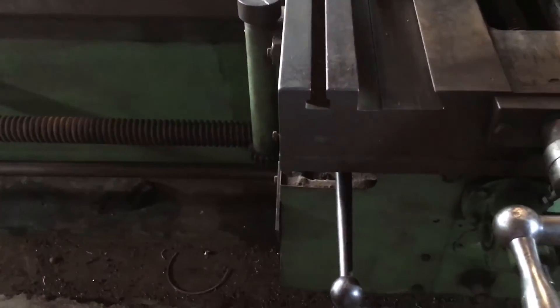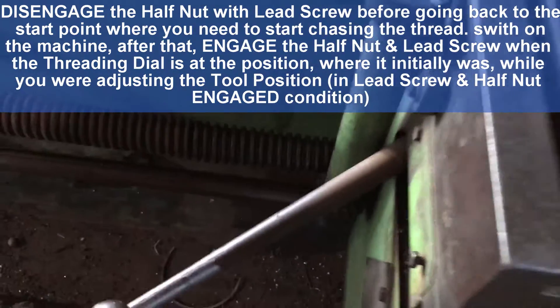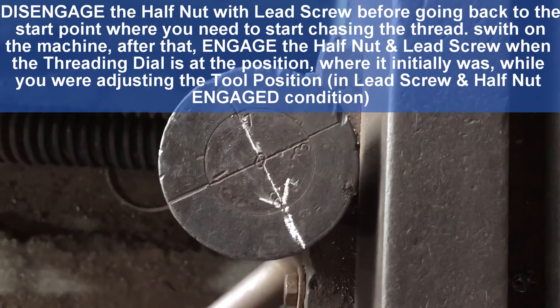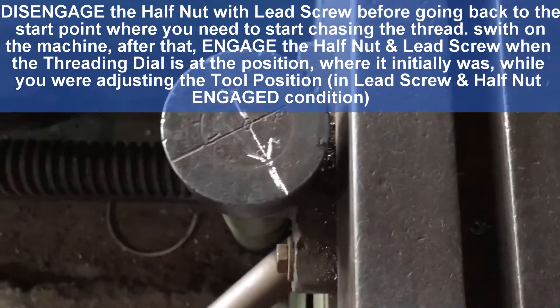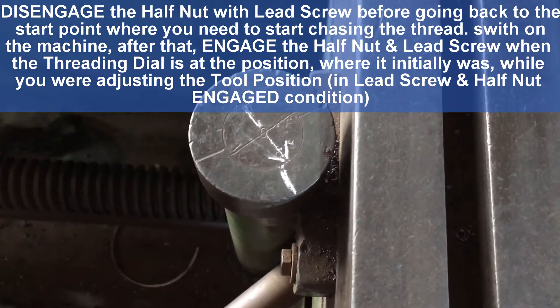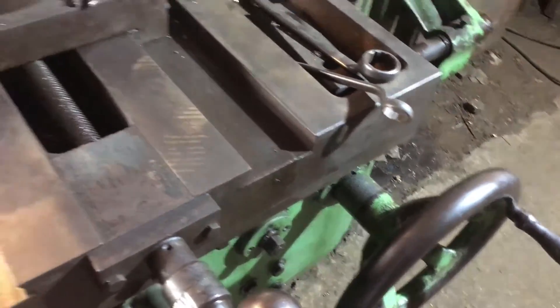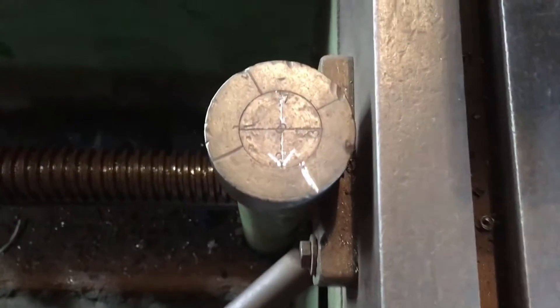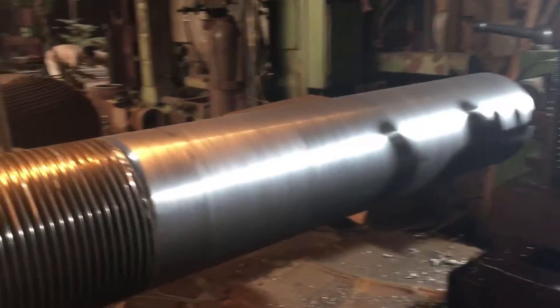Our adjustment with the tool has been made. The lead screw is still engaged with the half nuts. Before we turn on the machine we have to disengage the lever and keep an eye on the position of the threading dial. Then we can turn the machine on. You will find that the thread dial has started to move again because the half nuts are not engaged with the lead screw. Now we take the carriage back to where we want, and we can engage the thread dial on the arrow, chase the thread, and we will match the existing thread on the shaft. Now that our machine is all set up...